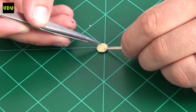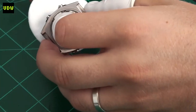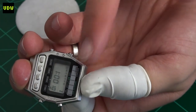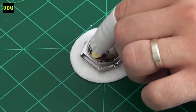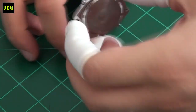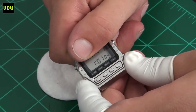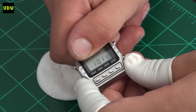Even without a battery inside you can see the watch works in direct sunlight — here it's facing my window. If I run my finger in front of it, it immediately dies out. The purpose of the cell is to store that energy so the watch works even when not in sunlight. It's basically like a capacitor — I believe it's even called a capacitor cell. You can see it works and flashes showing low voltage. If I put my finger in front of the solar panel it will not die out but will continue flashing.